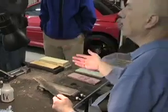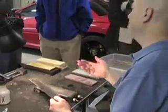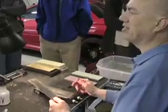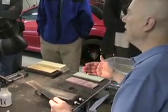You want to put your bevel on it. In my case, when somebody sends me one, it's their bevel or it's a factory bevel or it's damaged. So either way, I'm going to something like this. I'm not going to fart around all day with a 1,000 grit stone. But after you've sharpened for a while, you always want to use the stone that's the least aggressive.